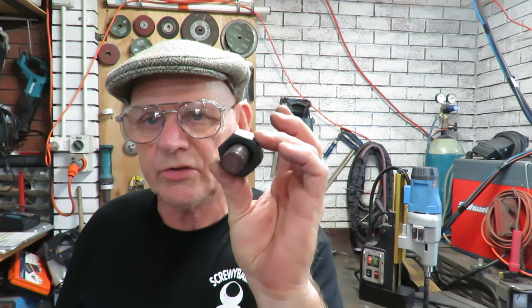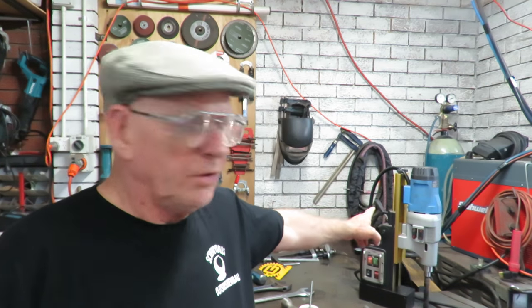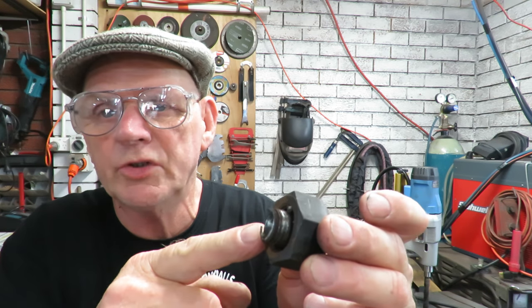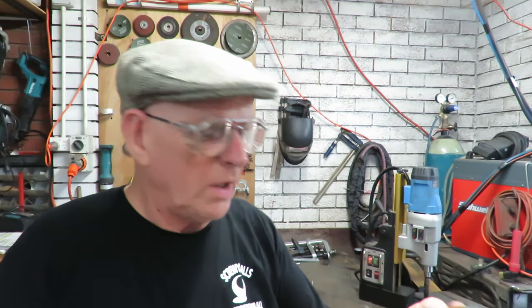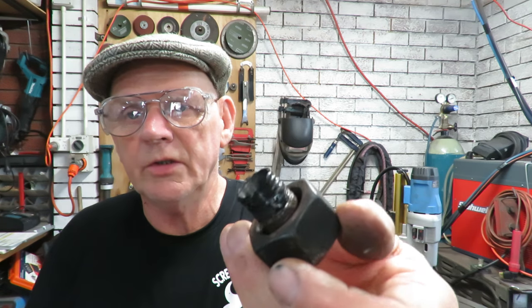One of those I did manage to unscrew out and the other three resisted. So I flipped the flange over and I drilled holes in the flange with the roto-broach — a magnetic drill. I drilled down through the thread, just past the thickness of the flange, and then I managed to unscrew them out. That way I got three of these studs out.